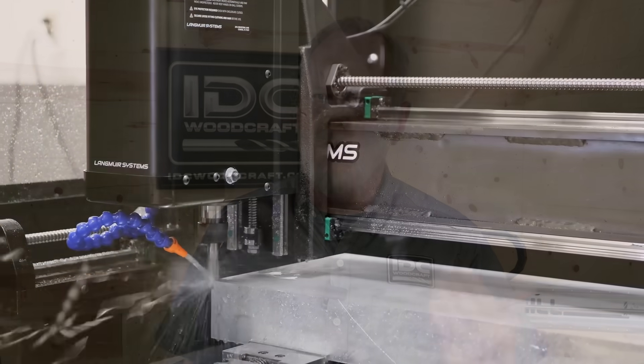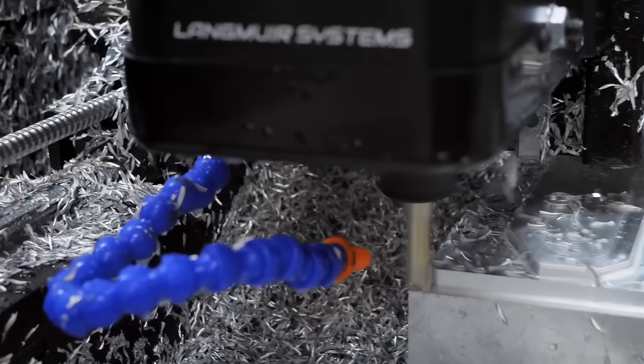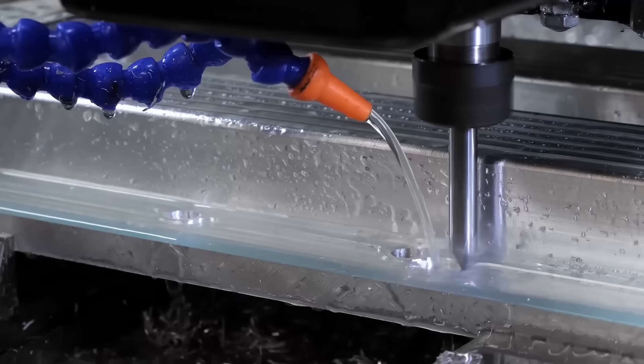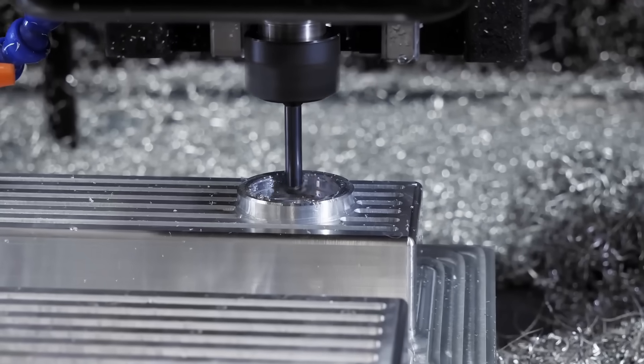When using a small step-over, you get a better finish on the edge of the cut; with a large step-over, you get a rougher finish. Also, use a small step-over for your final cut when precision is needed. In CNC machining and metalworking with tight tolerances, you make rough cuts first and then do a finish cut to exacting tolerances — that finish cut uses a very small step-over.